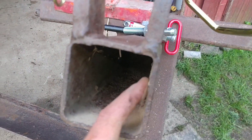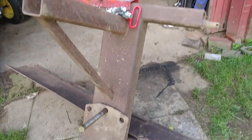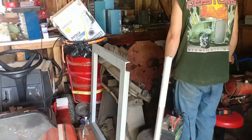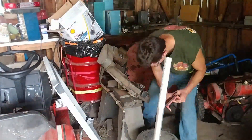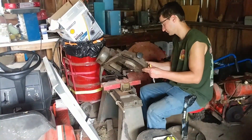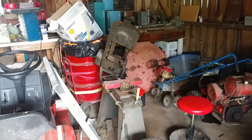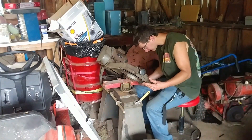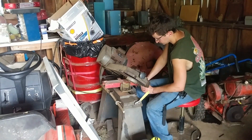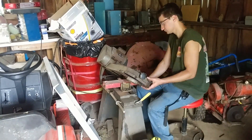This is where the seam is, so I'll just take the angle grinder in there and open that up, then weld it solid again. First things first — let's cut this piece at four inches. It's really nice having a metal-cutting bandsaw like this. It does not cut the straightest, but for our needs it does pretty good. Those two bars welded to the top caused an issue, so I eventually ended up using my portable bandsaw to finish the cut.